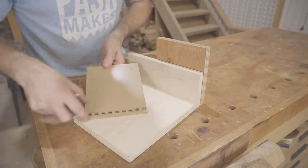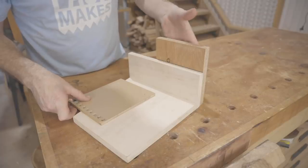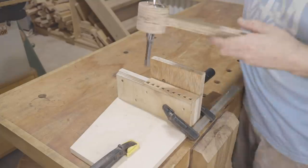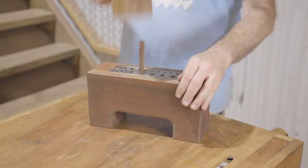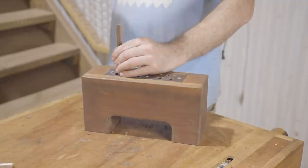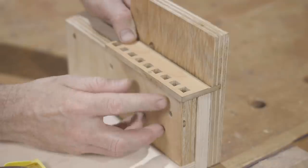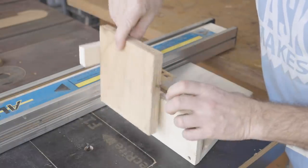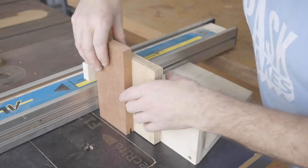I'm going to try that first — I'll make use of the template that I cut short earlier, cut it even shorter, and then make a dado in the back of this piece of plywood. This piece will set in and form a carriage we can clamp the workpiece to, then move it along for each cut. It needs a pin to index the template. To do that I'll drill a hole using the mortising bit, using the chisel just to keep the bit aligned so I can accurately drill the hole in the correct position for the pin. I'll make a hardwood dowel — I need a 3/8 of an inch dowel which is 9.5 millimetres; my dowel maker goes down in half millimetre increments so that worked out great. I cut the dowel down a touch more and rounded over the edge — it ended up being a perfect fit. I've added a small piece of plywood to the side to make it a little easier to line up the workpiece, then clamp the workpiece on with the thinner shoulder towards the face of the jig.